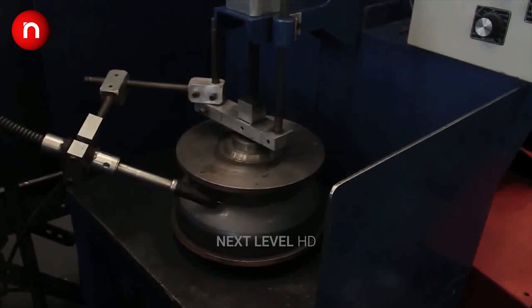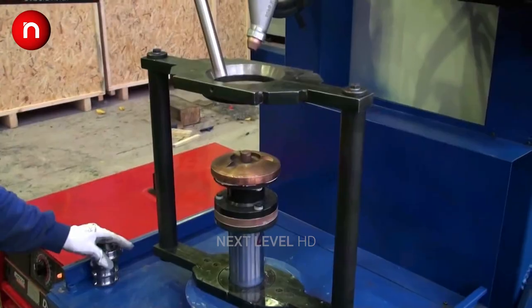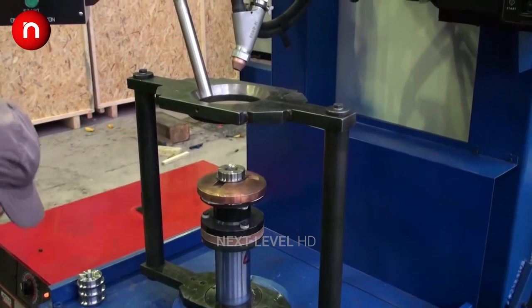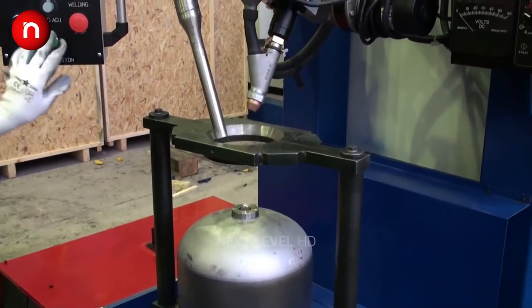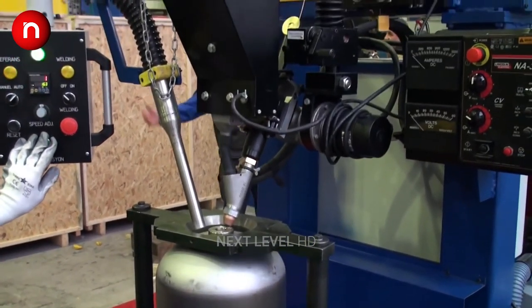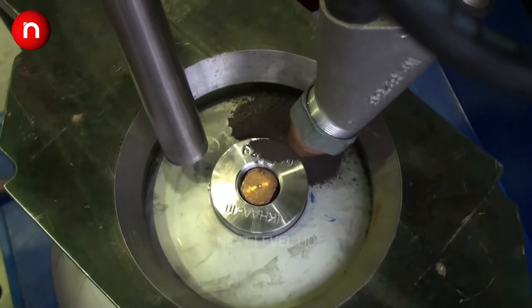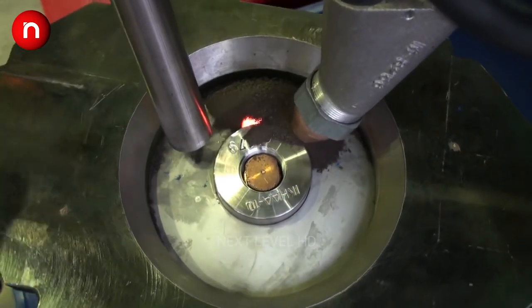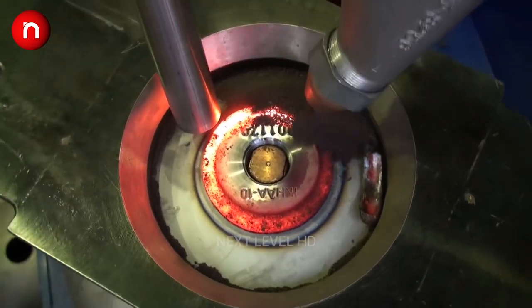There is the round bending of the blanks and MIG-MAG welding of the foot ring blanks. The steel rods are induction heated up to a forging temperature of 1200 degrees centigrade.